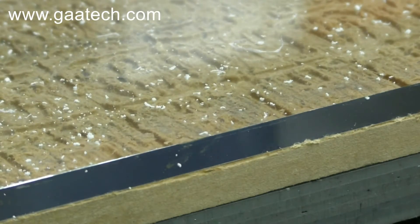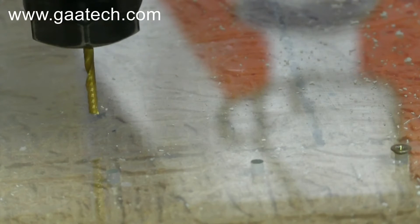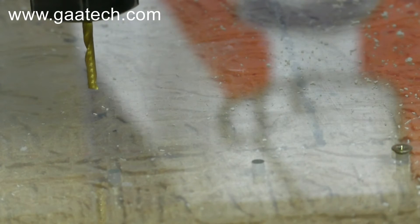I've put three screws along the part and now I'm just going to reset the Z and find where the spindle is. I'm just going to reset the Z back to zero. On Mach3 now I'm just telling it that I've reset the Z so it knows where the top of the material is. And now I'm going to run it and it's going to start pocketing the numbers.